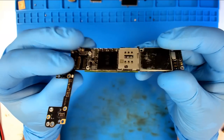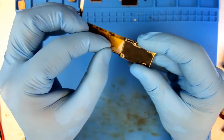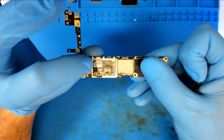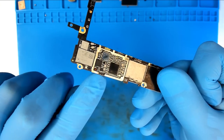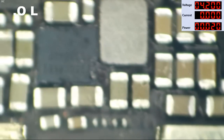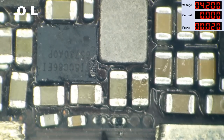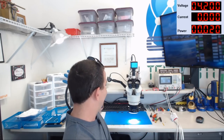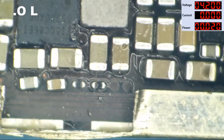Removing the board, we can see the bottom sticker has been removed and replaced with a piece of Kapton tape. I can see with my eyeballs that we've got some pry damage around the metal shield — somebody has already cut a piece out of the shield. The only reason somebody would do this is to check these two resistors right here. These two resistors are responsible for creating an I2C data and an I2C clock line. If either one has a problem, you get the phone drawing 80 milliamps, dead, 80 milliamps dead, exactly like this one.